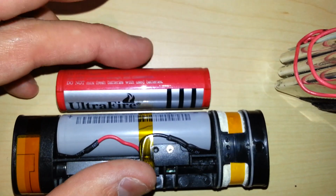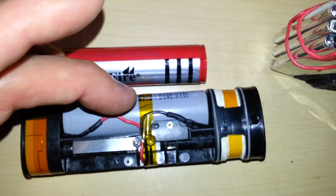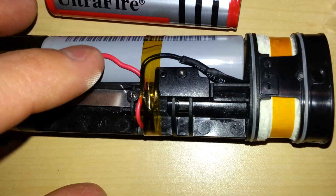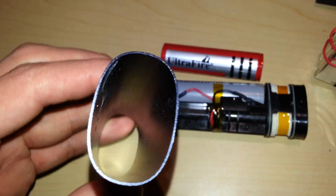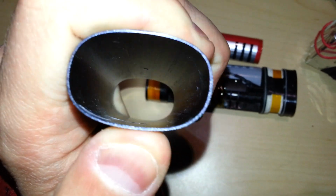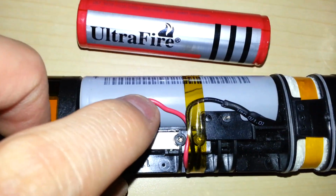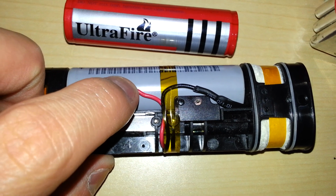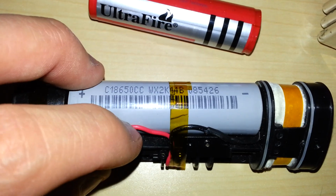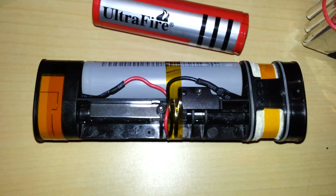They could have had a tab coming over with a fiberglass sleeve and soldered it that way, and been protected. But also, with how narrow the tolerances are, this is chintzy aluminum. I can actually bend it. You can't see it, but I can see it with my eye. If this nicks down to this gray part, and over time wears, which it would at that point, or the insulation fails, this will catch fire and you will be screwed.